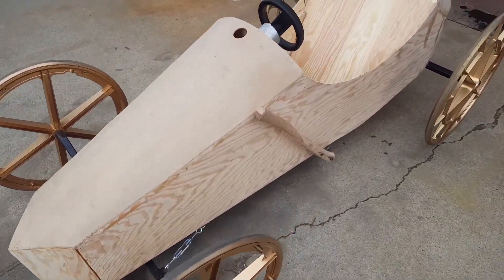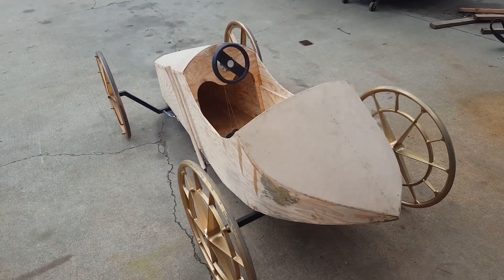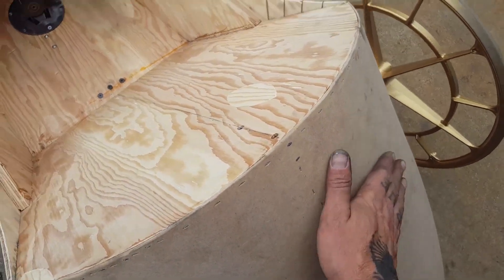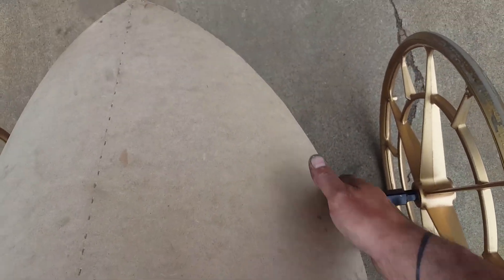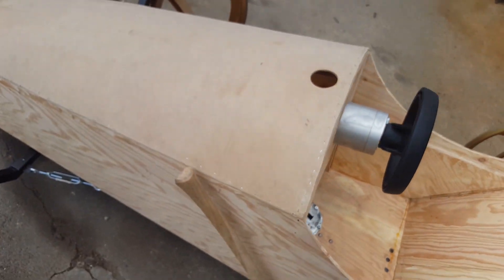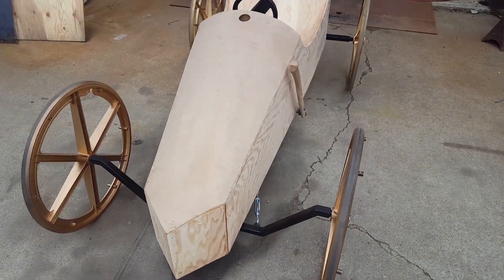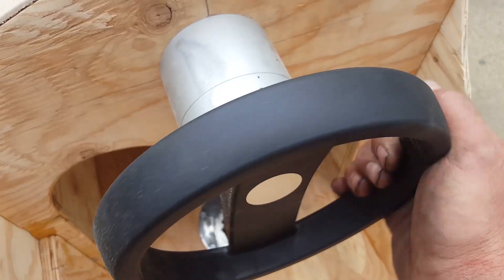Right side up, the body is obviously a homage to those 1930s racers. I used a constant radius to make the boat tail — just a constant circular section — which makes it easy to bend because you're only bending in one direction. It's quarter-inch plywood sides and three-quarter-inch plywood for the subfloor, seat back, and all that.